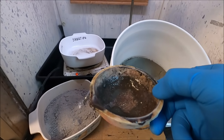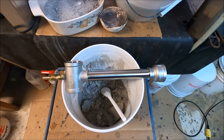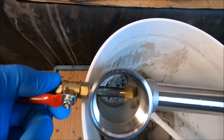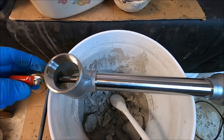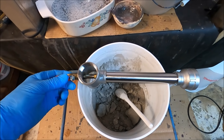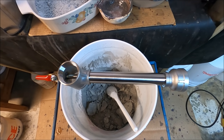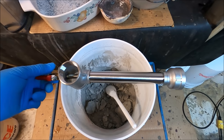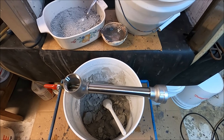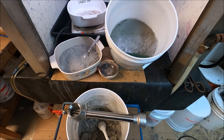Normally what I do is melt it in this little melt dish, but this is just too much silver to try to do that with. What I have here is a stainless steel burner for a propane furnace — I bought this on eBay, I'll post the link in the description. It's made out of stainless steel, well-made and well-constructed, already all configured. I could have made my own but this was about 40 bucks with shipping. I've ordered a couple crucibles and I need to order some castable cement to make the furnace. So that's the update on how we're going to get this silver melted into shot so I can run it through my silver cell.